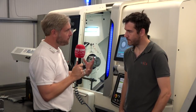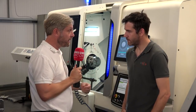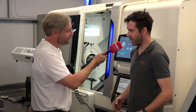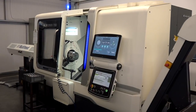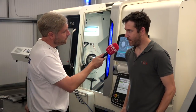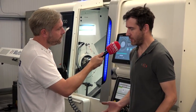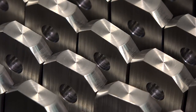We mentioned wanting to keep the machine running as often as possible. What about warm-up and thermal growth? To be honest, the machine is that good and that rigid — we don't get any of those issues. I can quite happily turn it off on a Friday, turn it back on Monday, and you're only talking a few microns of movement, even from a cold start. In terms of accuracy, we've been holding about 10-micron limits really easily, even in tricky materials like aluminium and bronze.